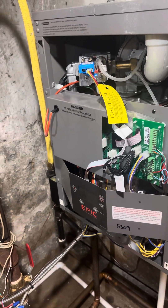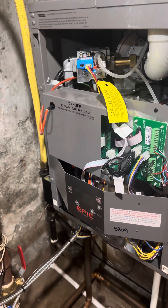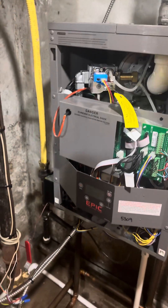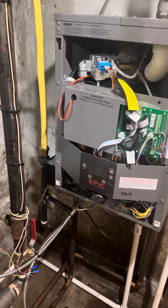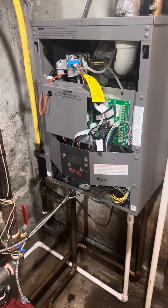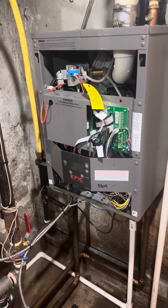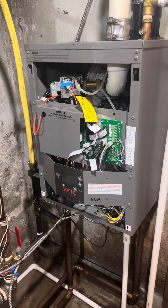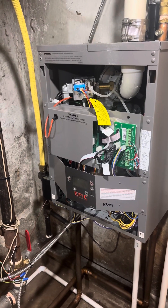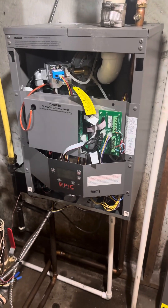The only thing I would say — in my notes there are a few spots in the description of a few of the wiring harnesses where they didn't tell you clearly to disconnect something that you would have to disconnect in order to get the heat exchanger out. So just keep an eye on that. But again, pretty straightforward — about an hour and a half total time on site, not including travel. Lochinvar is doing a recall on this so you will get reimbursed for your time. Good luck, I hope this helps somebody out there — it's not as bad as it seems.